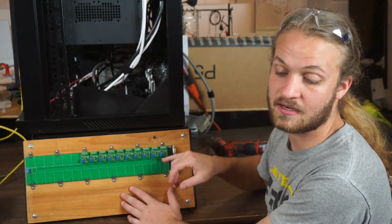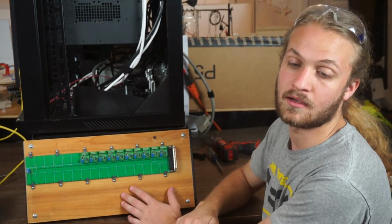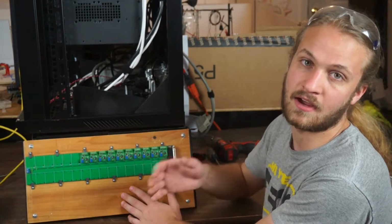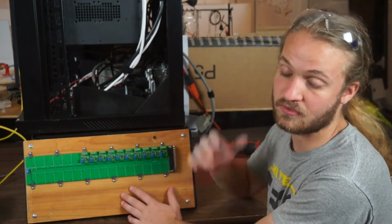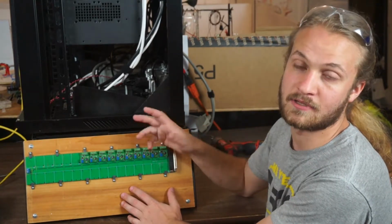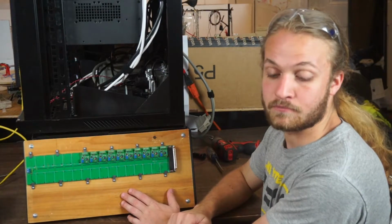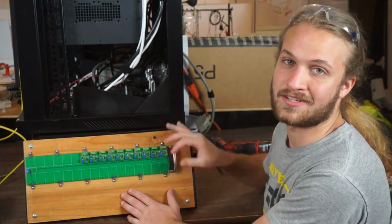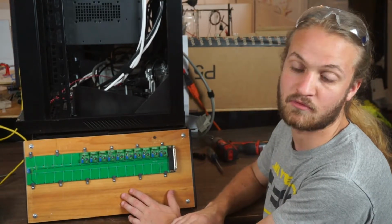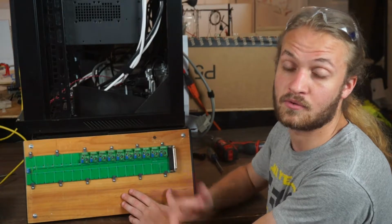This allows us to get an individually controlled power supply for each one of the sensors, especially because a lot of the sensors run at different voltages, maybe 5 volts, 3 volts, 10 volts, 12 volts, anything like that. And this allows for a clean, isolated supply from each other. There's also some analog filtering here as well to help get rid of any high-frequency noise that might show up in the test equipment, maybe from a gasoline generator we might be using to power the whole system or something like that.